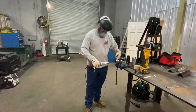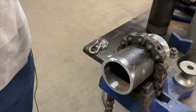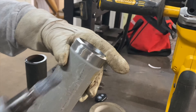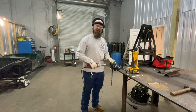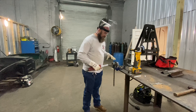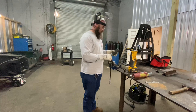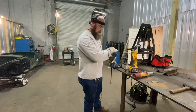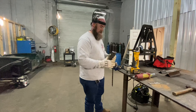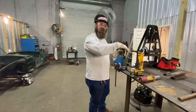You can see inside and outside all the way around — a finished product should look something like this. That's schedule 40 pipe; what we're working with today is schedule 80. Prep and cleaning is very important, especially when you get down to alloys and different materials. If you're hand beveling your pipe, it's really important to keep it square as you're beveling it. I've seen bevels come in all the time that are off like this, and it makes for a hard weld if it's not prepped right.